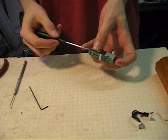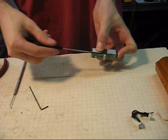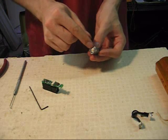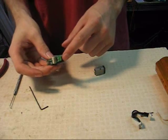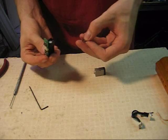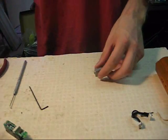For disassembly, you're going to have to separate the spool section from the rest of the sections. This is done by taking a small screwdriver and inserting it into the screws at the long end. Once both of them come loose, the coil and pilot will just come apart. There's a butterfly gasket right here — it's the black part. It might come off with the pilot or it might not; it doesn't really matter. I prefer to have it installed inside the pilot section — it has a small depression that it fits inside, so you can just drop it in there. It'll make reassembly a little bit easier. Set these parts aside.